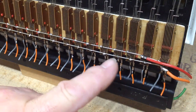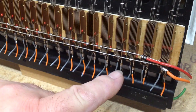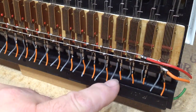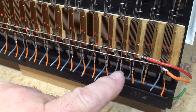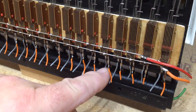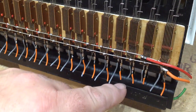So when you press the key down, the orange wire connects to the lower bus, and the grey wire connects to the upper one. What's of interest is that the orange wires all have diodes on the end of them, between the wire and the key. And that's really useful, because that's what we need to have for it to work with our own encoder.